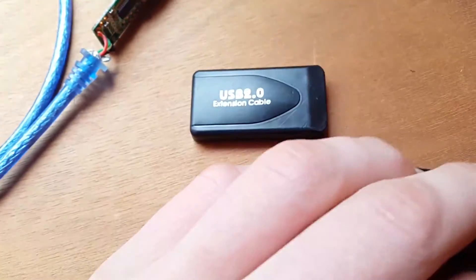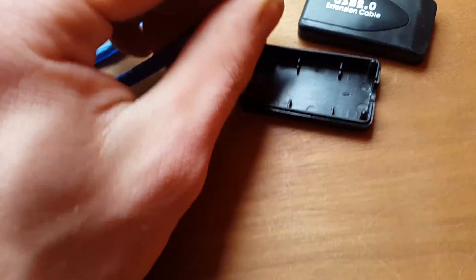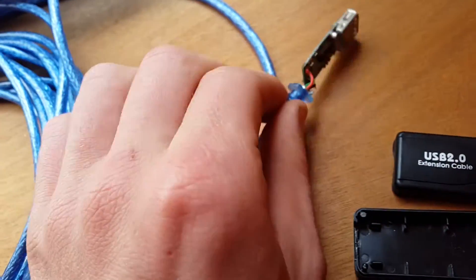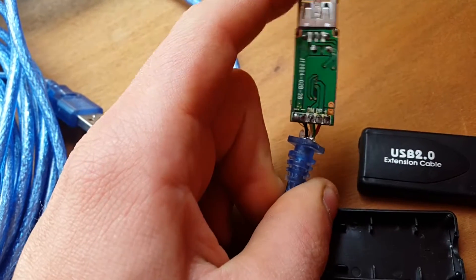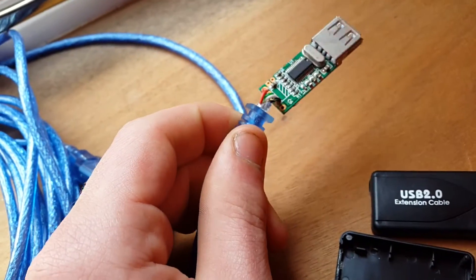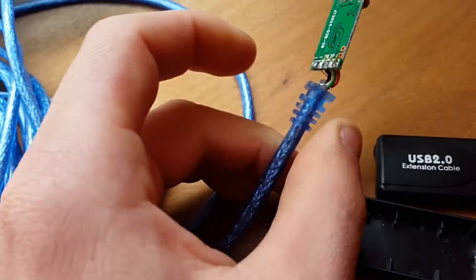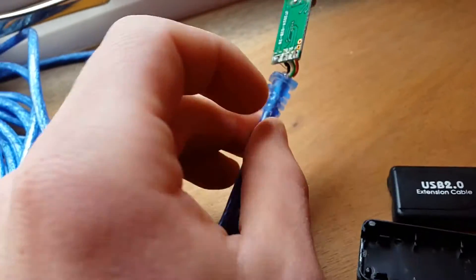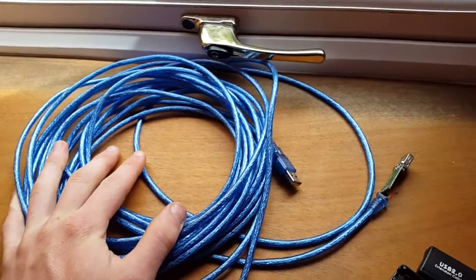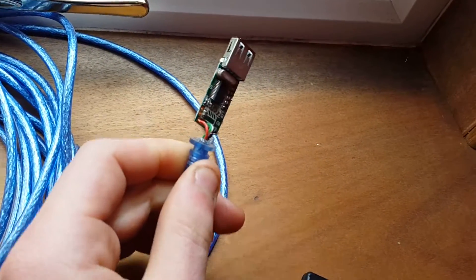It came from the seller Digiflex, and that's just a plastic case that goes on the end. I'll get the power supply soldered on there and I'll solder the metal shield on correctly. Although, with software defined radios, in some cases they work better without the shield actually connected, because the cable itself can actually act as an antenna and pick up unwanted signals. So I'll try it with and without, and see what it does to the noise floor.